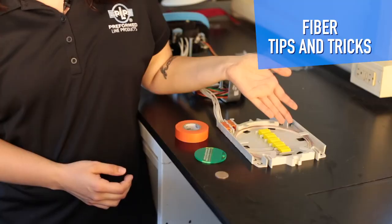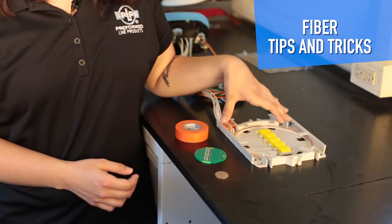Here we have a Coyote light grip splice tray. This splice tray has an internal width of six inches, which is above the industry standard for splice trays today. That helps us eliminate macro bends when routing and splicing fibers in the Coyote trays, creating a better signal for the end user.